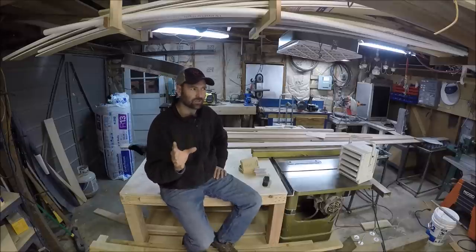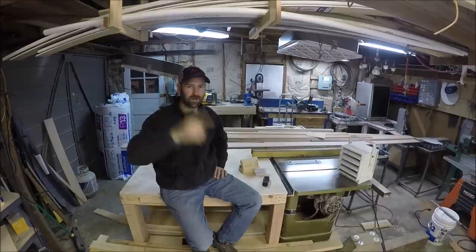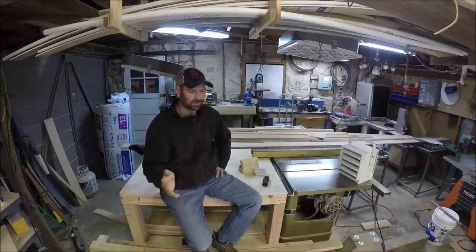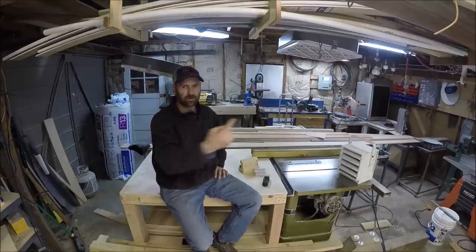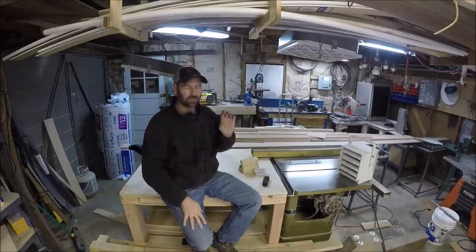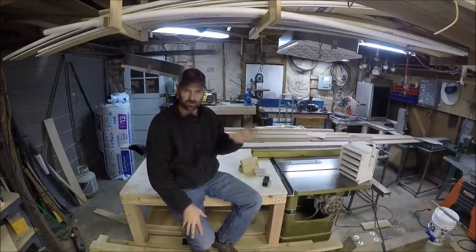The next question that some people brought up, and it is something to know when you're doing soffit and fascia as well as a roof, is that you have to have adequate ventilation. There is a basic formula, and you can just Google it and figure it out. You take the square footage of your attic and divide that by 150. That gives you the square feet of ventilation that you want to use.